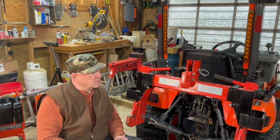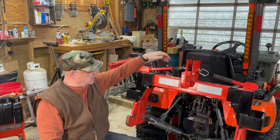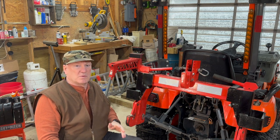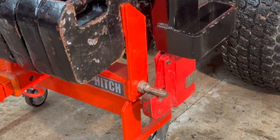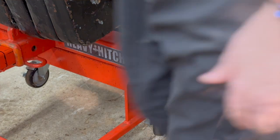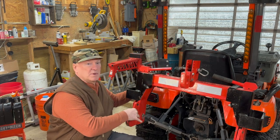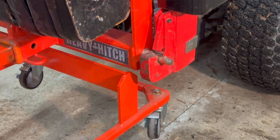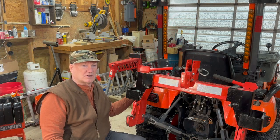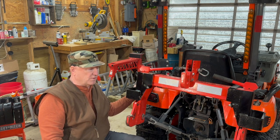I wanted to show you something before I go. One thing that's really cool is this opening and closing mechanism right here — it secures it. But when you put an attachment on, for example when I move this Heavy Hitch over, I won't have to open these. You only have to open them to remove it. To put it on, this is actually spring-loaded — see that? It's sprung. So you can go over, put your quick hitch under it, lift up, and it'll automatically seat down into the notch and lock itself in place. If you're on a big tractor, they've got bigger quick hitches for larger tractors. The Spico fits my subcompact just fine — Category 1.